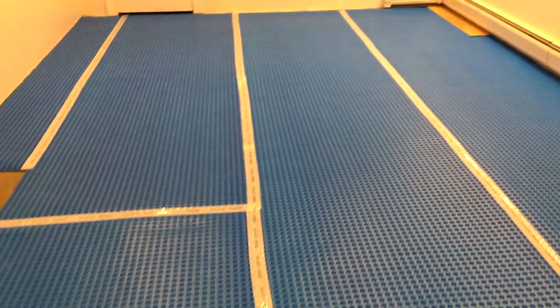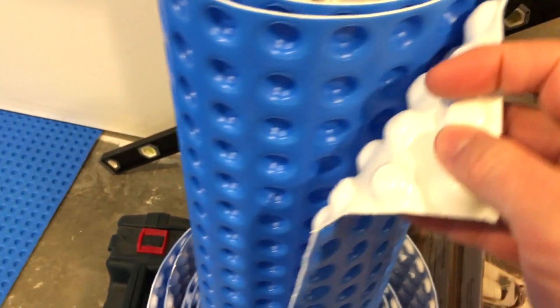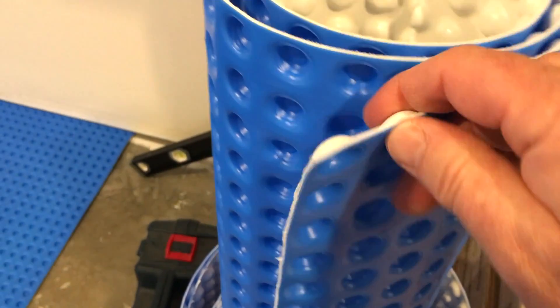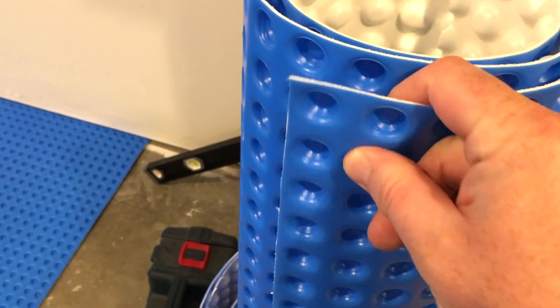Between each piece that you roll out — a row here is roughly 27 feet. I got one unused here in the box; it's about just over three and a half feet wide. Here's the backside: it's foam on the bottom and it has all these bumps, but that allows air to travel underneath the subfloor, allows the concrete to breathe, plus acts as a vapor barrier. It's hard plastic on top.